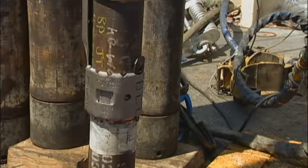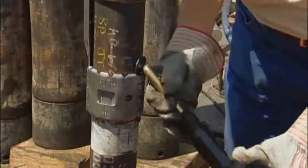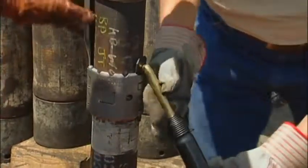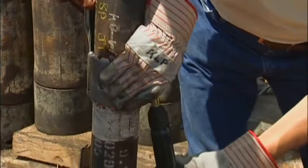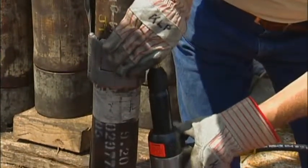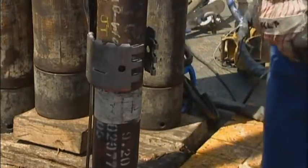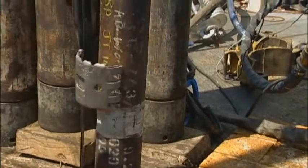Use caution when removing the taper pin from the taper pin loops. As the taper pin is being removed, slow the speed of the air hammer. Place a gloved hand over the pin driver and taper pin to prevent the pin and protector from falling after it is removed. Always wear personal protective equipment when working with installation tools.